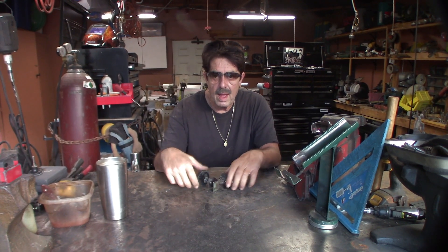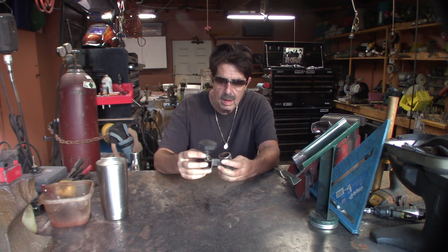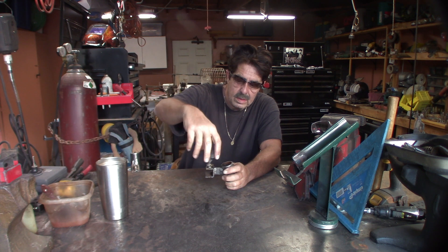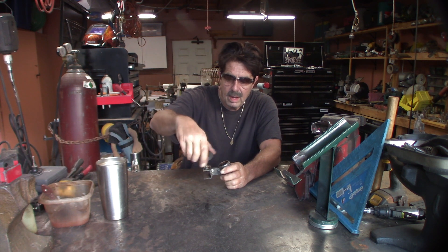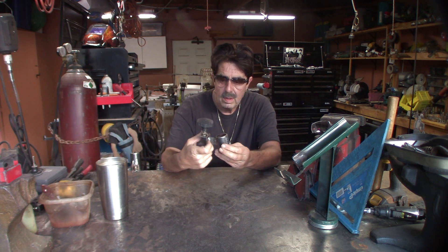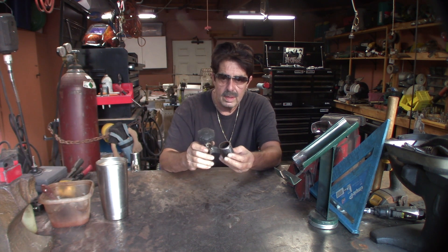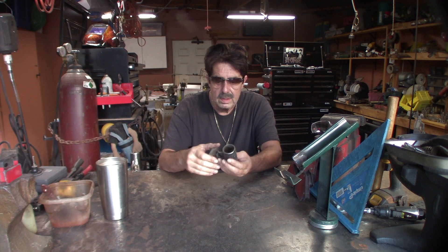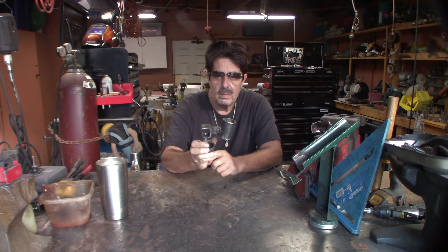We're back. I put a little MIG weld here and a little one here — it holds that nut on and I've got the bolt hole going through the channel piece. This bolt on the handle will screw down and hold it in place. I went ahead and welded on the little bridge piece and cleaned up the pipe with my four-and-a-half inch angle grinder. Not a beauty show — just something real functional. Now here's a word of caution where a lot of people make a mistake.